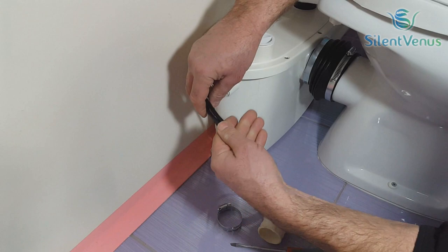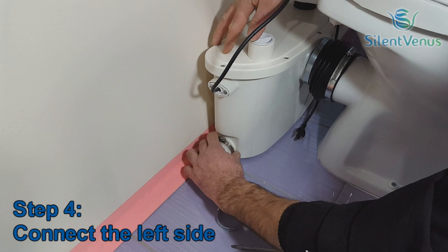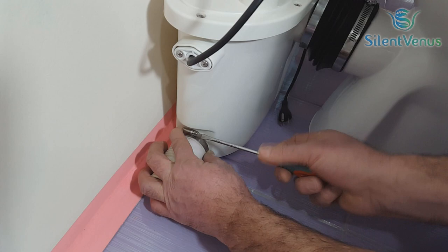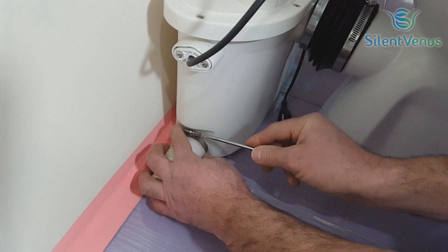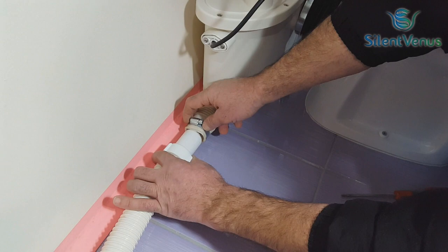Step 4: Connect the left-side connector. The pipe is coming from the bathtub. Secure it with the provided metal clamp. Where possible, long sweeping bends should be used. Do not use short elbows. If sweeping 90-degree elbows are not available, use two 45-degree elbows to make a 90-degree turn.